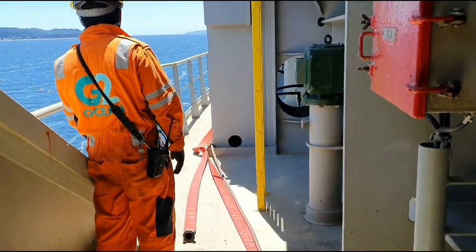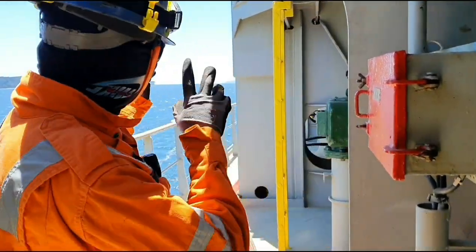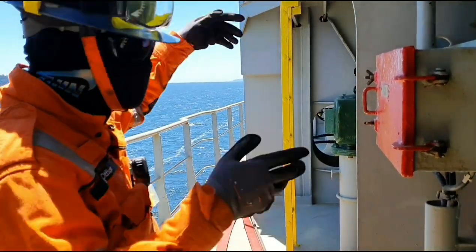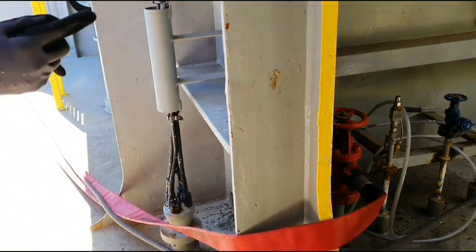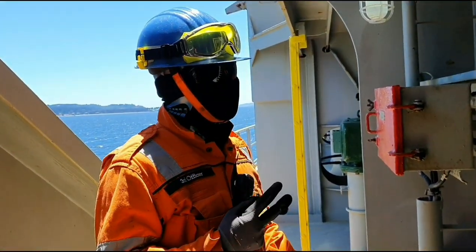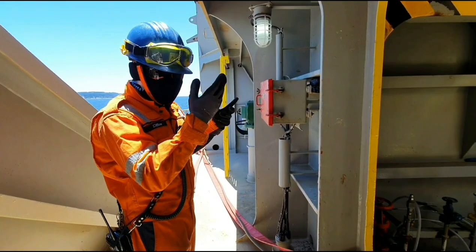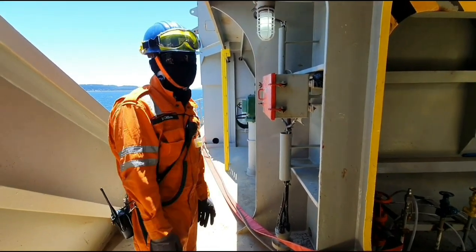Now that all fire hoses are laid out on deck, the strategy for our annual fire hose test is to connect the fire hoses in one line. The end will be connected to a fire hydrant forward, while the other end will be connected to a nozzle aft, which will be tied and secured. With all 51 fire hoses, we will have to prepare at least 6 fire hydrants and nozzles.